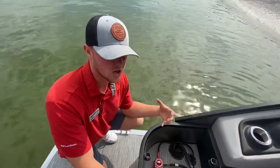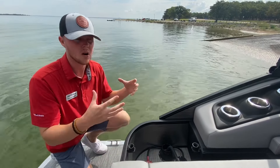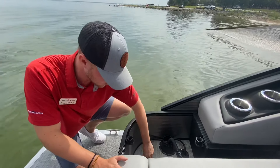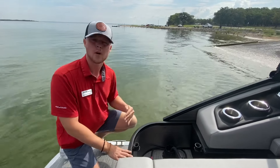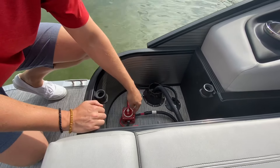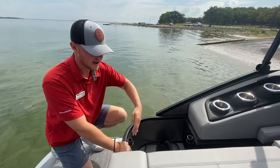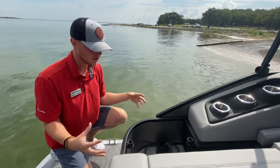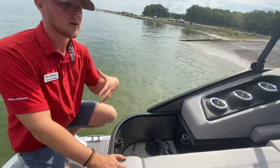A good way to manage this is called the calendar method. For whatever day of the month it is: if it's an odd day, go ahead and use battery one; if it's an even day, use battery two. That way you're cycling through both batteries, and if you accidentally drain one all the way down, you have the other to crank the motor back up. The one-plus-two setting should only be used if neither battery alone has enough power — you parallel them together to get enough juice to crank the motor. Right now we'll leave it on battery one and continue.